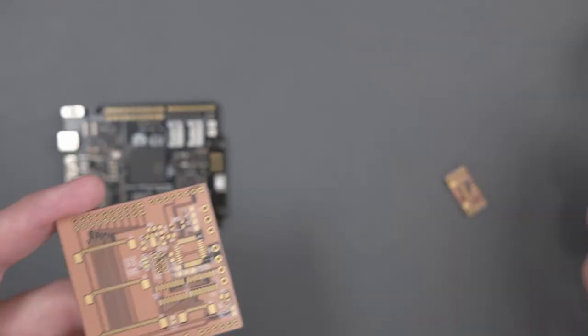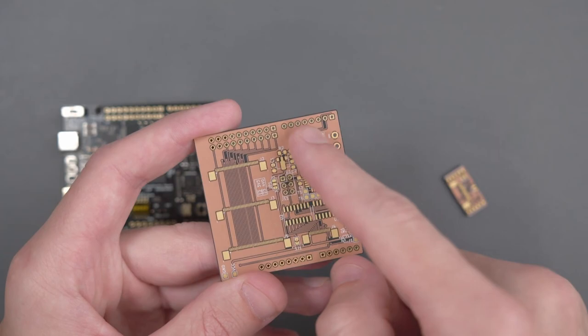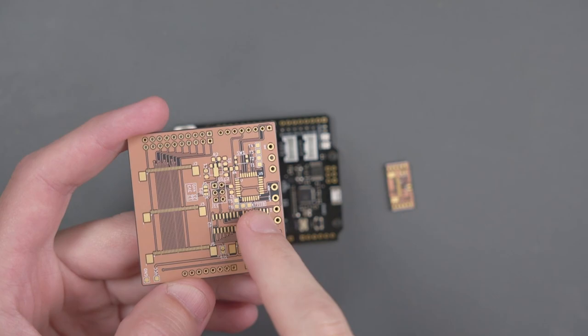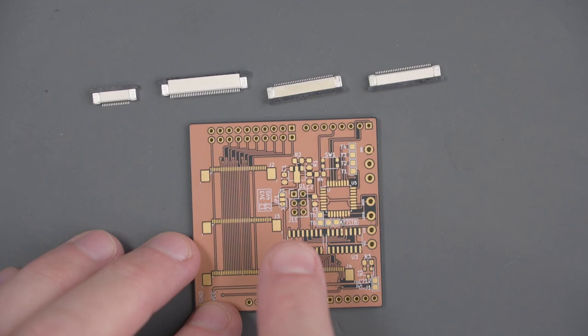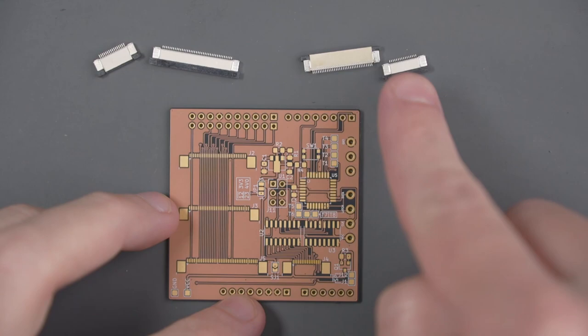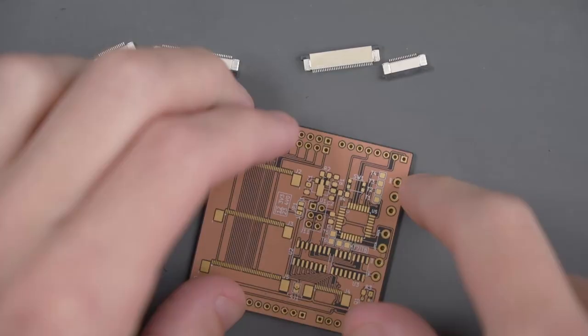This GBA HD shield is not readily available. I had to order this PCB from Oshpark, and I have a whole bunch of components that we're going to have to solder to it in order to move forward with assembling our GBA HD. I'll leave a link in the description to the GitHub page for this shield, which contains the Oshpark files as well as the bill of materials for all the components you'll need to populate this board. Probably the hardest part of assembling this shield is going to be these flat flex connectors. The nice part about these FFCs is that they're all different sizes, so you shouldn't have to worry about putting the wrong FFC in the wrong place.